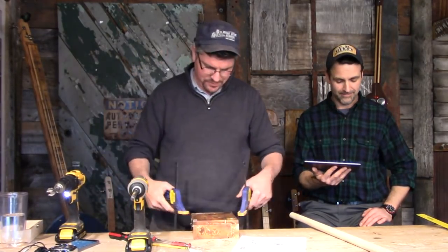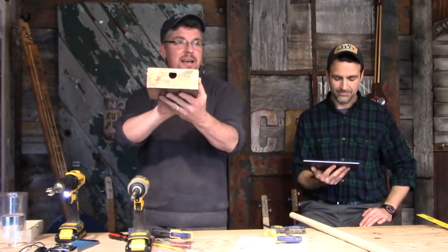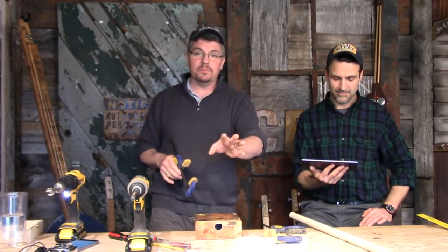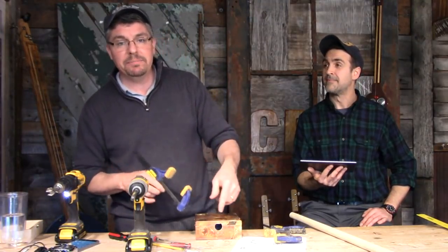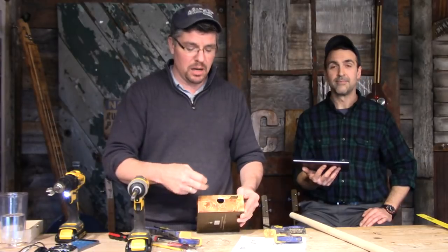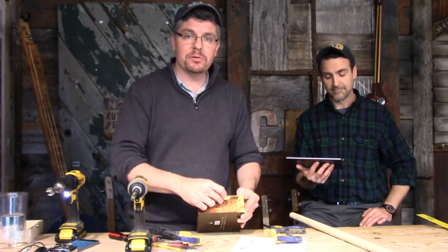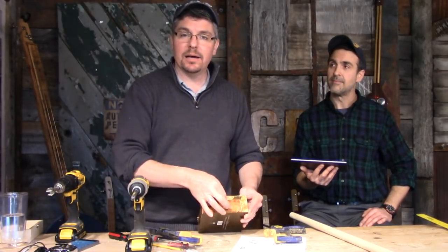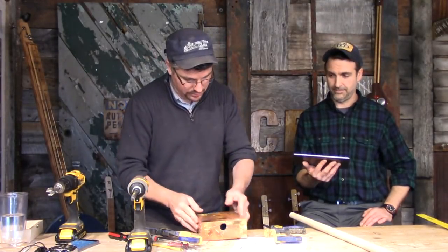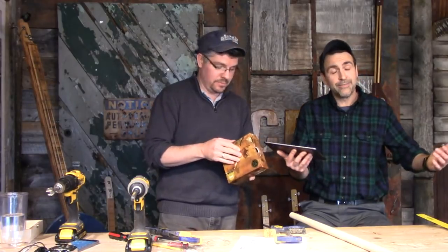No trouble. So that's one side with a nice 1-inch hole in it. Now I get to do the other one. And just to be clear, I had pre-measured according to the instructions, found the halfway point on the box, measured down 3/4 of an inch to get this neck placement properly spaced. So I'm not just freehanding it back here, although you certainly could. There ain't no rules.